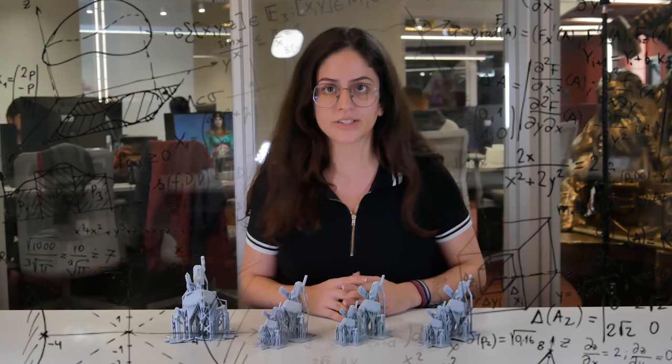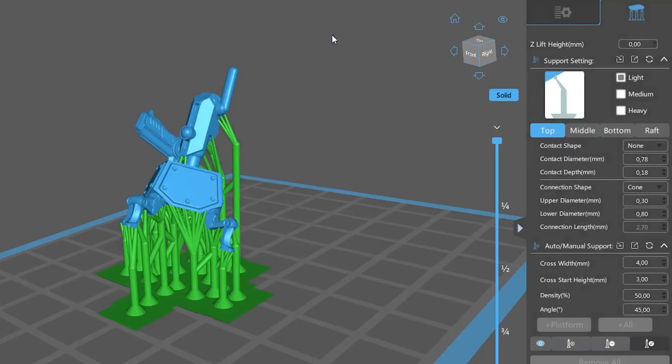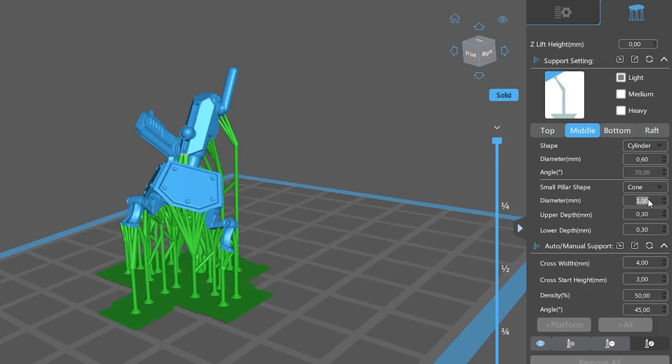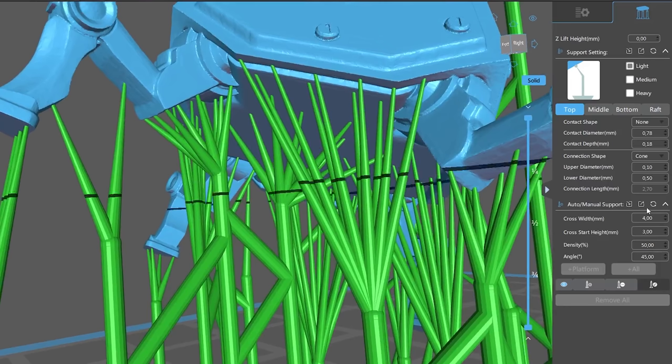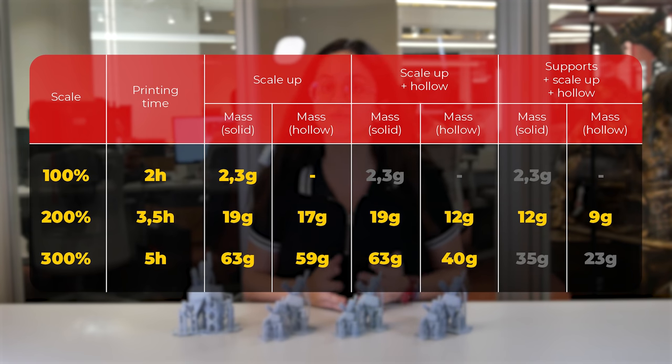In the third case, we have some previous steps that involve calculating the proportion by which we should decrease the supports. But in the original project we have several supports with different configurations, so any individual change is practically unfeasible. Therefore, we will select all supports and consider the greatest contact point between the support and the part, as well as the standard pillar thickness, to facilitate the process. We have to define what scale we would like — for example, if we increase 200%, we know that a 1mm diameter column would now have 2mm. So if we want the 200% scale model to have support columns of 1mm, we should first decrease the support diameter by half, including reducing the contact with the part. The result of scaling the part to 200% was 12 grams of resin.